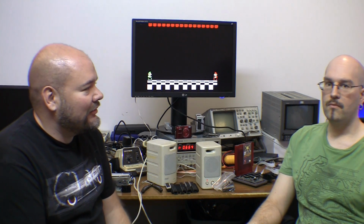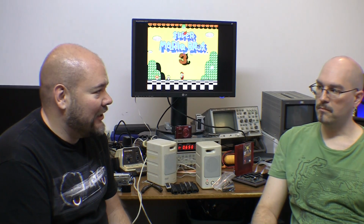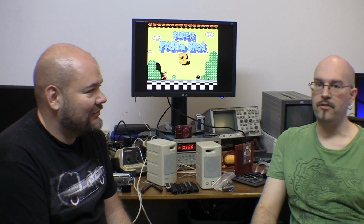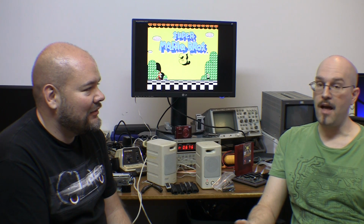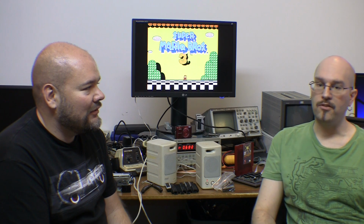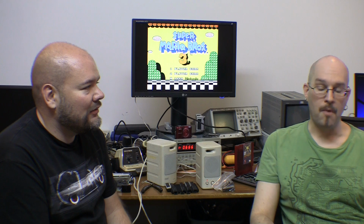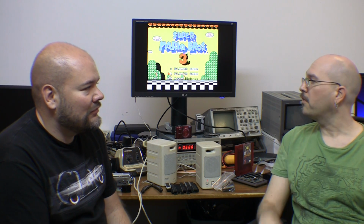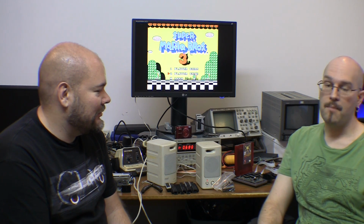Another thing about the big problems with doing 1080p or HDMI is that a lot of people have a frame buffer in there. There's no frame buffer on this, so there should not be any controller lag; the only lag in the system is in the monitor. I buffer about 8 or 10 scan lines' worth of video, such a small amount that there's no delay to speak of between the controller, the system and the monitor. So there's no frame buffer, no nothing.